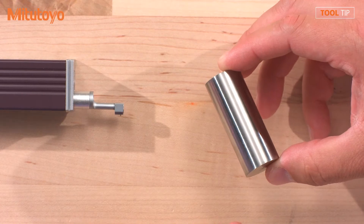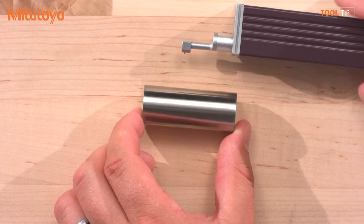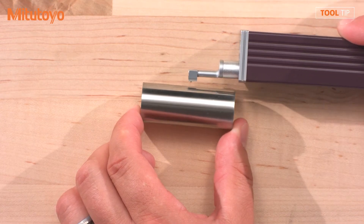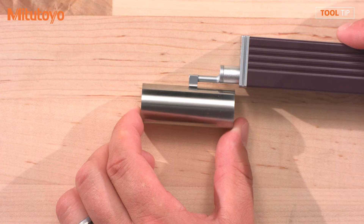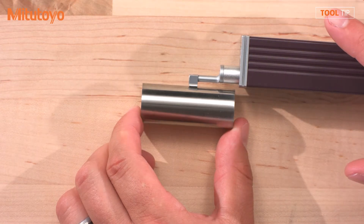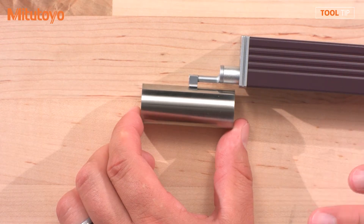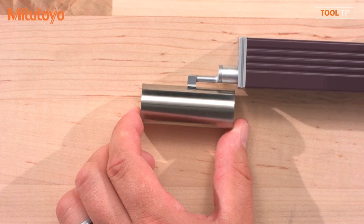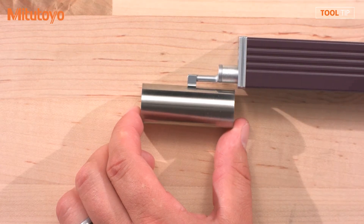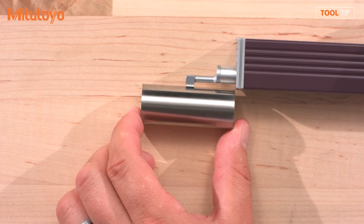Let's say I wanted to measure along the axis. If you're measuring along the axis, a skidded unit would be great. What's important with the skidded unit is that after it makes contact with the part, the skid is always in complete contact with the surface being measured. If you look at the skid here, there are no gaps between the skid and the part anywhere. It's not sitting at a weird angle where the beginning or the end of the skid is off — it's nice, even contact, so if you move the stylus back and forth, it's always in contact with the part.